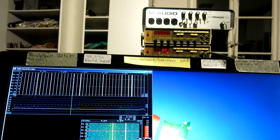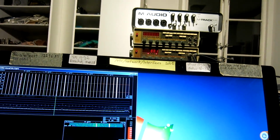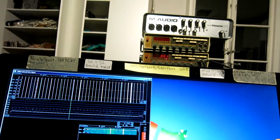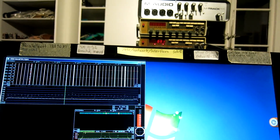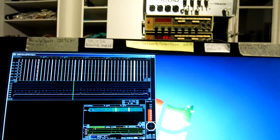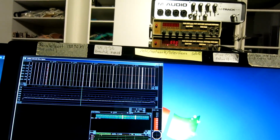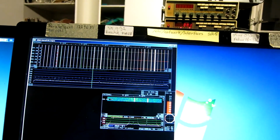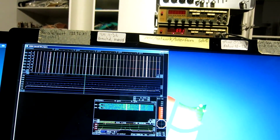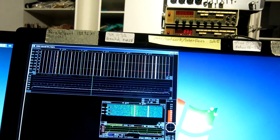And of course I can change the width, maybe 50, to make sure it is really well removed. And maybe minus 590 is more appropriate. And I can make the notch narrower, let's say 5. And that's not good enough, let's say 15. And at minus 585. Now the notch is very narrow, it will not affect the desired signal at all. In Linrad you can apply up to 9 notches within the baseband. It is manual, it could be automated, but I haven't really met any interest for that.